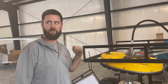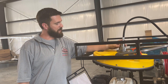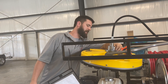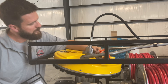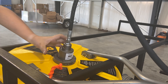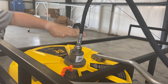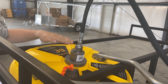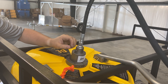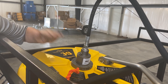Another thing — free tip Friday is wild today on the first one, we're giving out all kinds of tips. This bearing is actually adjustable height-wise up and down. On the back side here, there is an allen bolt that basically squeezes this collar together and clamps down on it. So if we need to move the tips up and down to get further away from the concrete or closer, we would loosen this, take a hammer and knock this down very carefully or knock it back up, whatever the case may be, and retighten it right there to set your depth.